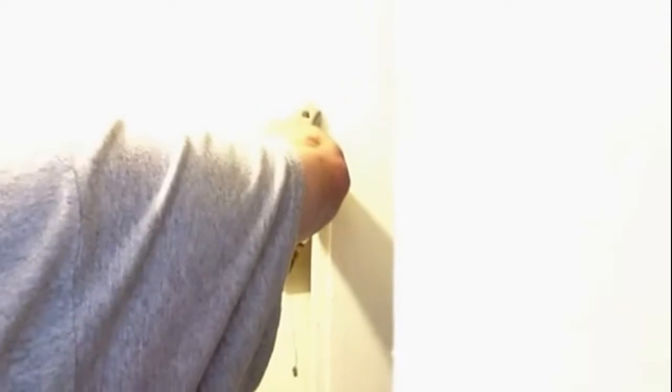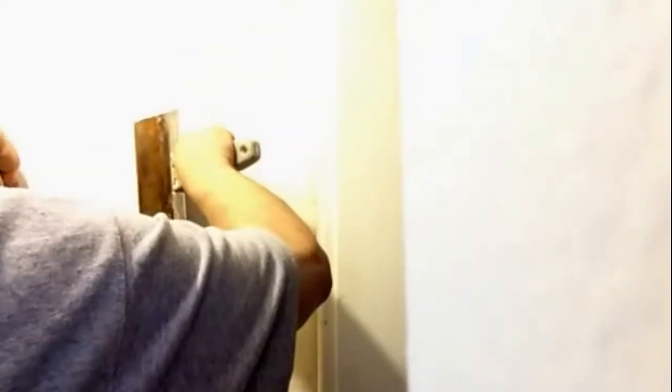This is a simple repair. This is just someone not doing their job. I'm going to set all the cracks that don't have tape. They probably didn't do it because it was in a closet. They probably didn't think it was very important, but it is. All your cracks, whether you're doing new drywall or patching in like this, should have tape on them.